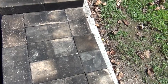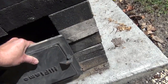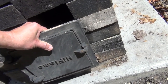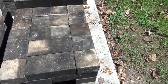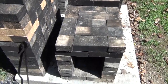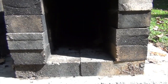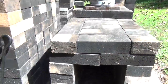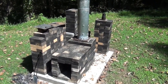I'm going to do a few more tests. An 8-inch ash clean-out door fits perfectly on a stove that's only two fire bricks wide. And if you just have the chimney going up the back, it's just your basic square firebox hearth — no grate — and all the air rushes in so aggressively from the front, the air moves so quickly up the back that you get a lot of smoke.